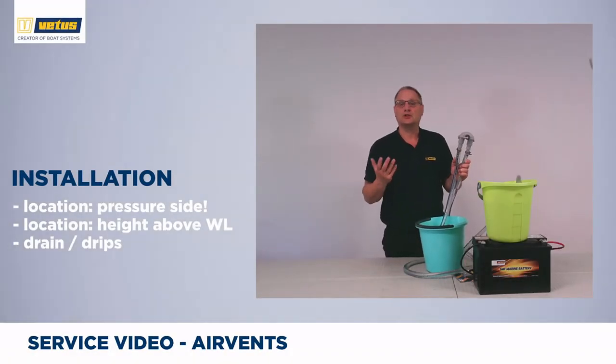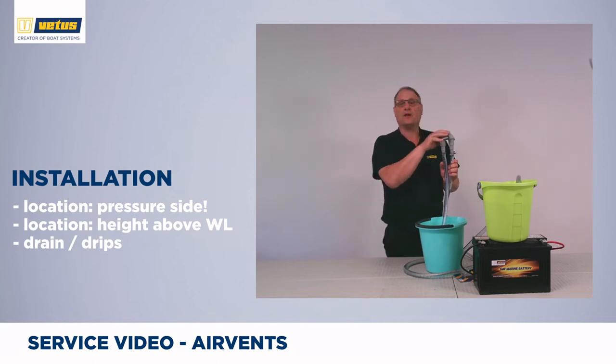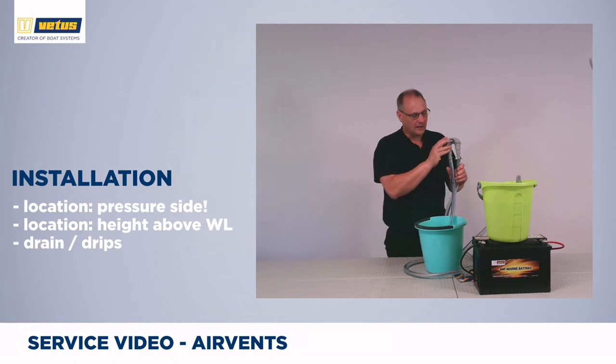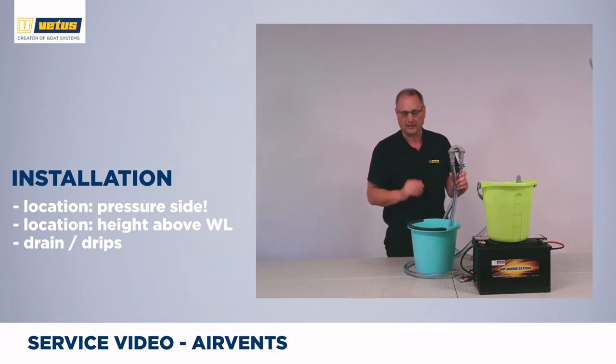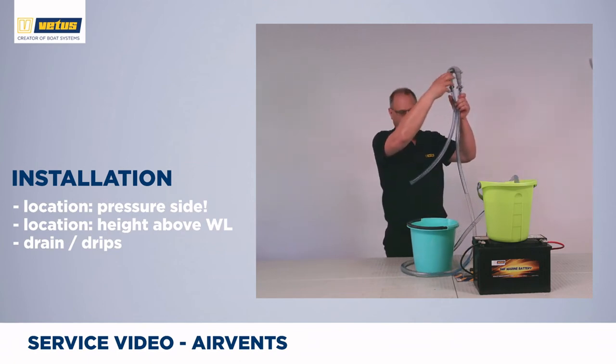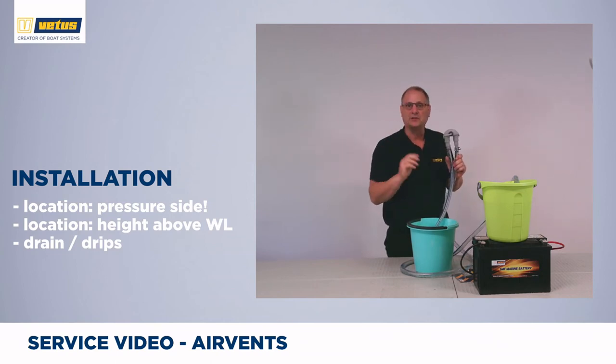When you install an air vent, there are a couple of guidelines you have to adhere to. The main one is where to place the air vent. Always make sure that it's on the pressure side of a pump, because the valve will close as soon as it feels positive pressure. If it's on the suction side of a pump, air will continuously be sucked in and it will ruin the efficiency of your pump. So make sure it's on the pressure side. The second guideline is the correct height. If it's too close to the water level, it might not open properly. But you don't want to mount it ridiculously high either, because now the pump has to overcome that static height in order to pump water out of the system. In the air vent manual and in your engine manual, we give guidelines on where to correctly place the air vent.